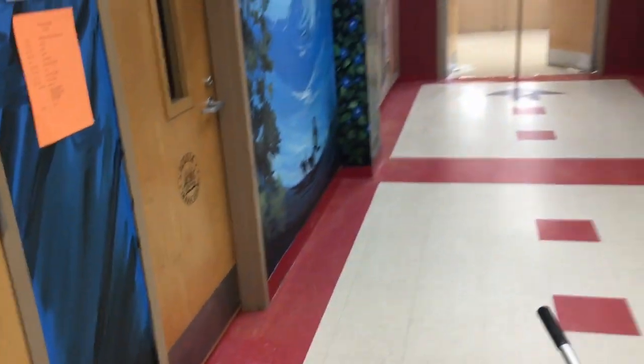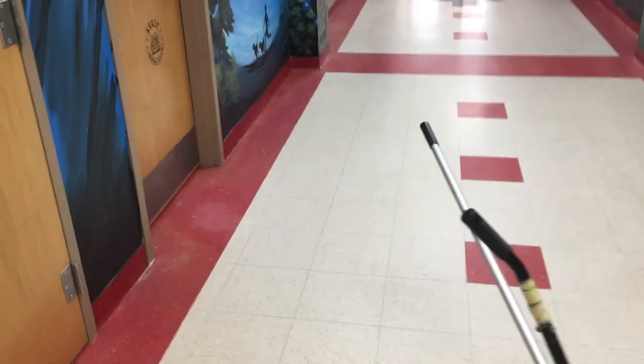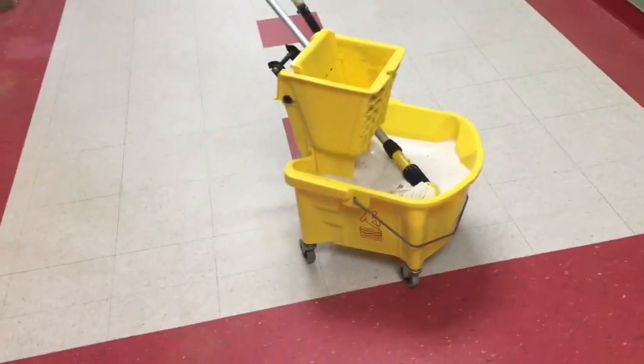So our hall has these little columns, and I usually go one or two columns at a time. You just kind of pace yourself. You learn how fast a waxer you are. You've got about, I'd say, 2 minutes on your edges. It depends on the humidity, the air, whatever, before you start getting that drag. But you don't want to drag a hole out on your edges.